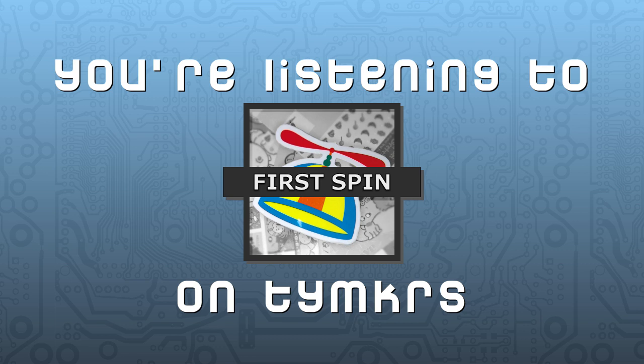In layman's terms: you prime PHSA so the pin comes on, and the value you set determines when it turns back off — that's your pulse width. The WAITCNT then enforces the regular 20-millisecond interval between pulses. There's a much easier way to do this, available on the Parallax kickstart pages at learn.parallax.com.